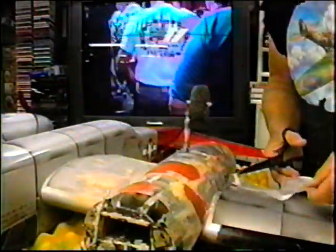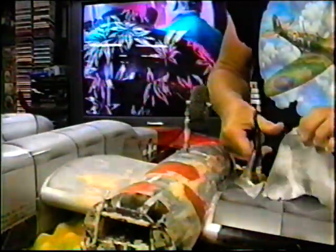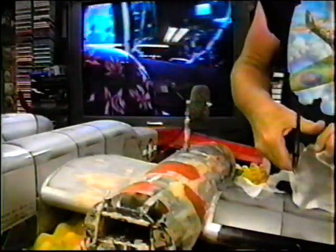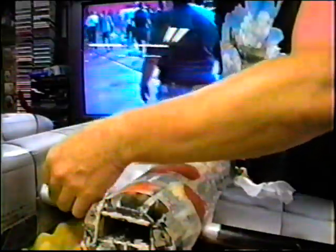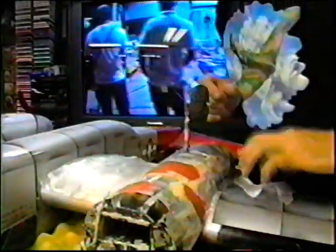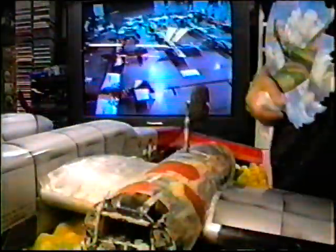Again, I want to cut all the cloth ahead of time. In fact, what I'm going to do is sand the whole top of the wing too, the idea being that I can do all the glassing in one operation. Get the pieces made up, get the extra little pieces made up. Okay, so I have a little pattern now. Now what I can do is go to the top. I'm going to flip this over, do the top of the wing the same way, and then try to do this whole glassing in one operation.